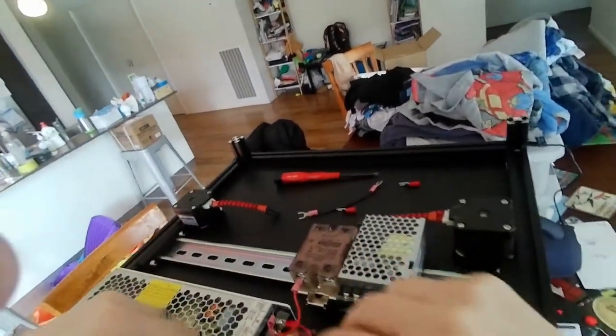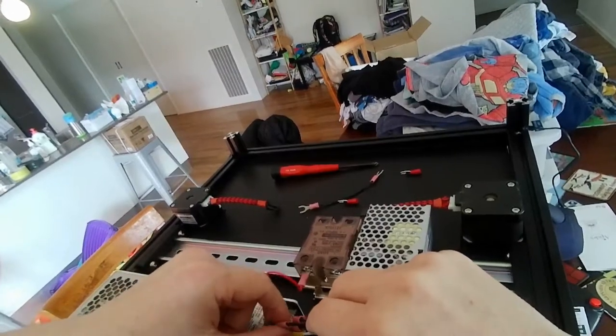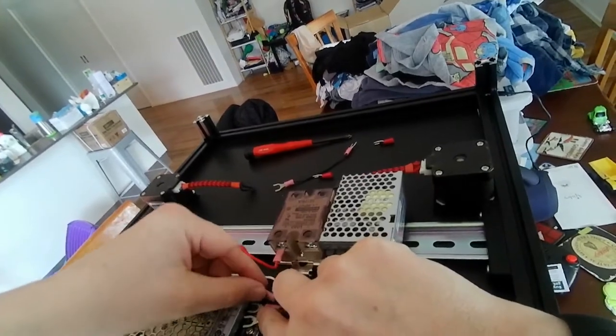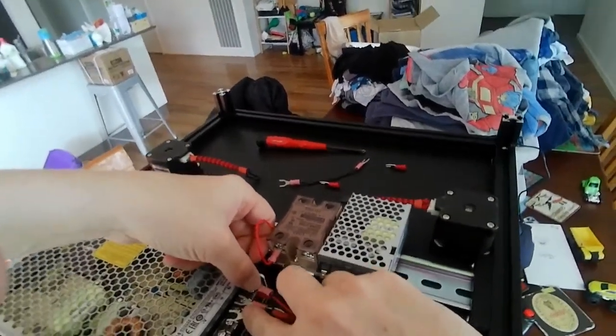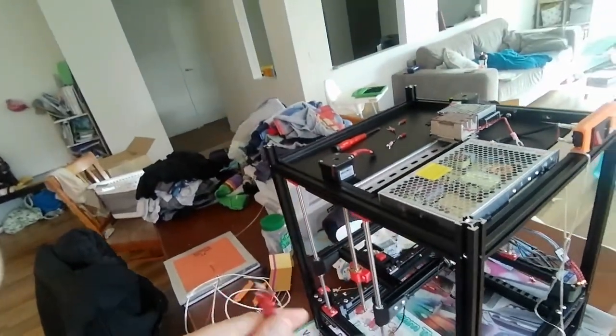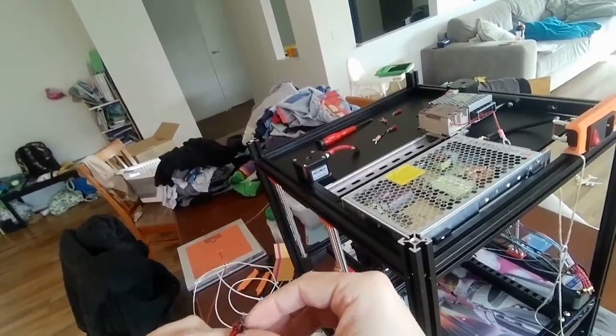What happens now is that I have three neatly arranged wires that I can wire up. Nice and neat. And I know because this is the only one I've done it to, that this is for the 5V power supply. So I'm going to crimp the connections. If you're wondering how to check which wire is which after I've done it, I can do a continuity check. I can also mark down on the actual spade connector with a bit of marker color to show the difference.